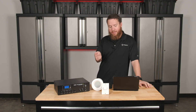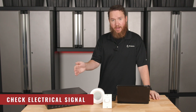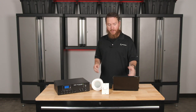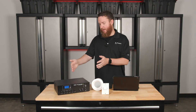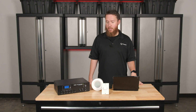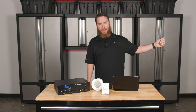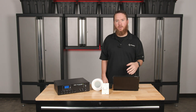We now have another option that not everyone has to do, but can be very useful if you have any electrical or handyman type experience. We can use our multimeter to check that we have electrical signal at each of the speakers and actually each of the positions, including the volume control if you have one in line. From there, if you still haven't found the issue, we may want to test individual speakers. We can do that by actually bypassing previous speakers in line. The signal connection from the amplifier to multiple daisy-chained 70 volt speakers is in parallel, so you can simply disconnect from one speaker and connect the wires to bypass it, to individually determine where the signal is breaking and what may be causing issues along the line.